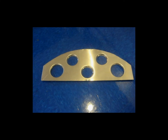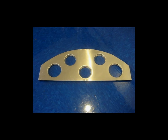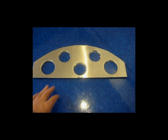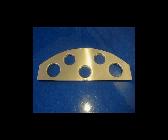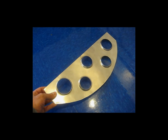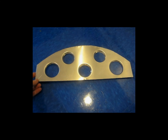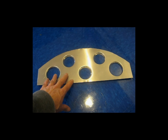This is my first attempt at flanging holes and I've got my custom made flanging dies already made. I made those out of aluminum. This piece here is aluminum as well — I believe it's 6061 but I'm not entirely sure. I just used a scrap sheet that I found and it wasn't labeled, so I'm not really sure what it is, but it doesn't matter for this particular application. This particular piece is the storage compartment door that goes behind the pilot.